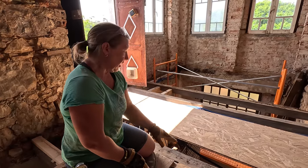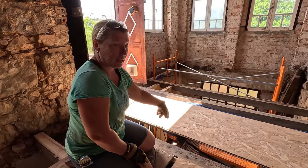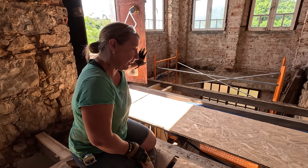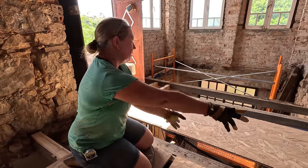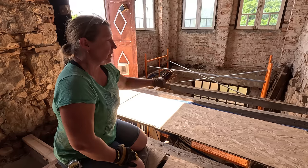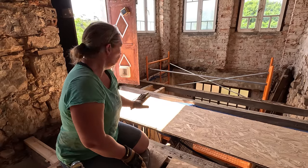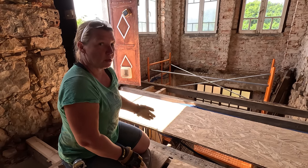The only complication with that is the bathroom wall that we built downstairs is screwed into those joists. The top plate, the wall plate on this one is screwed into it. So we're going to remove this temporary board, take it out. Then we're going to saw on either side of this wall, and then we can lift this side and lift that side, and then we'll unscrew those blocks from the top of the wall, and then we'll have this big space to also be able to work from underneath with some more ladders. So that's the first thing that we're going to do. It will also then allow us to have a bit closer look at the wall plate, which also has to be removed, which we're hoping will be the next step.